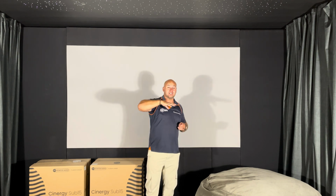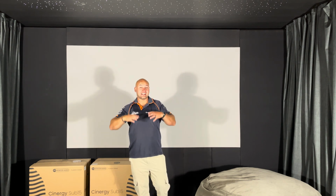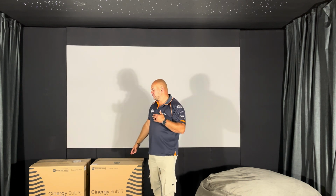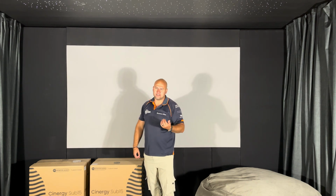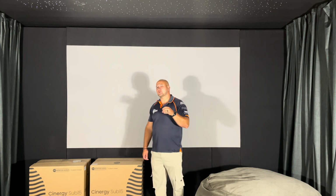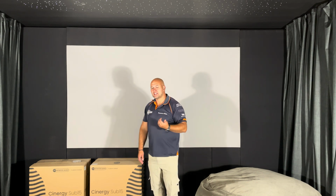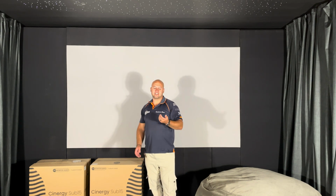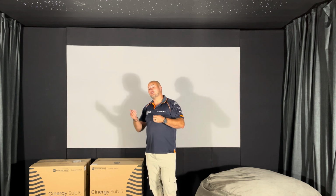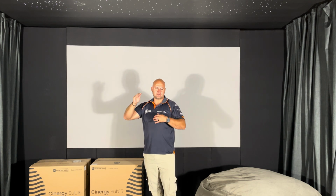All of the rest I will do 80 hertz, and then the subwoofers will be doing everything under 80 hertz down to what these can do, and the SVSs can do about 16 hertz, so I will drag those to 16 hertz. I still feel that's one of the only places that my cinema is lacking. I can't do infra. For those who don't know, infra is anything below 10 hertz basically. So I will be able to fill in that gap from 16 hertz down to 1 hertz type of thing.